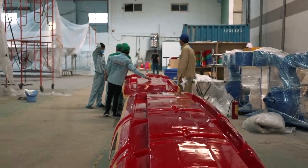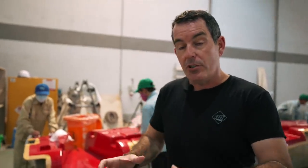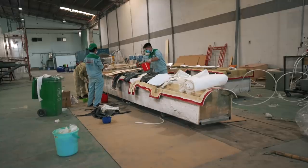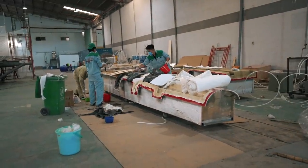If you've just got a gel coat and try to blow it out and there's a bit that's stuck, it may take you another day chipping that out. But by putting wax into that layer, you know you have 100% wax coverage. From watching this team work for a month now, you can see how much effort they put into making sure these boats all demold first time.